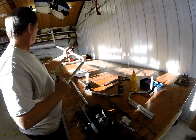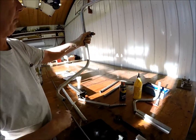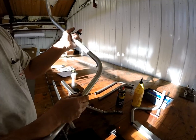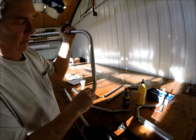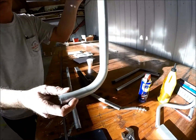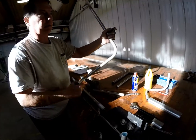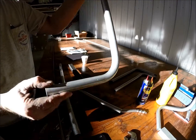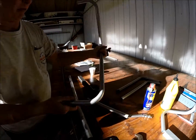On the next one, this was done with the mandrel bender but the mandrel was too far out. On this one there are still some ripples — the mandrel was still a little too far out. And on this one the mandrel was in the right position: there are no ripples on the inside, which means the OD of the pipe stretched.